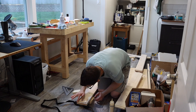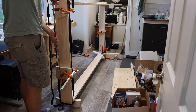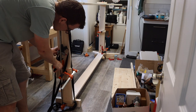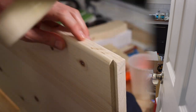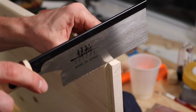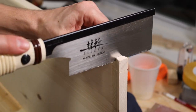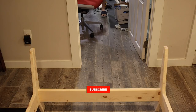This is only a twin bed so it's going to be easy to move around even if you can't take it apart. However, if you're going to expand this into a larger version — say a king bed — you might want to use some hardware I've shown in other videos; I'll link those above. The long dovetail on the headboard is going to be floating with no glue to allow for wood expansion, so I cut off about an inch on the bottom of the dovetail, then hammered it in place.